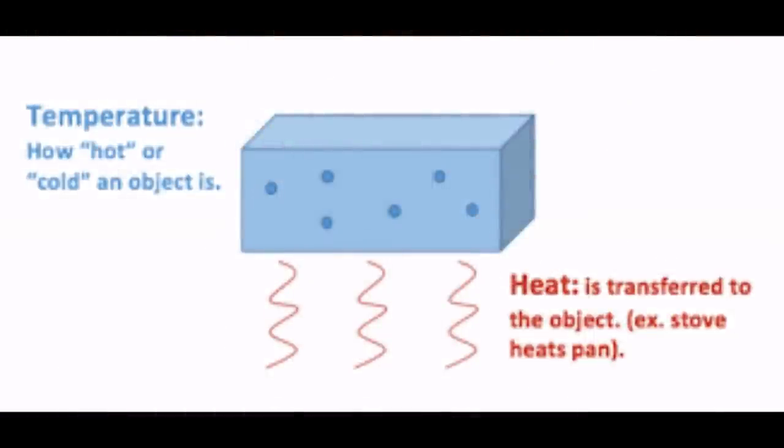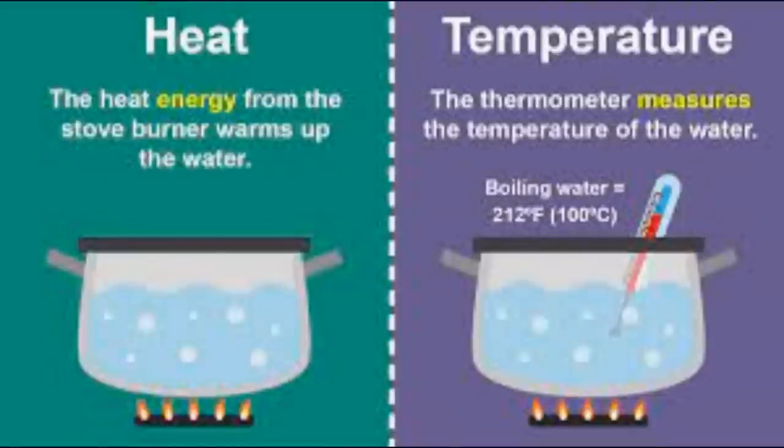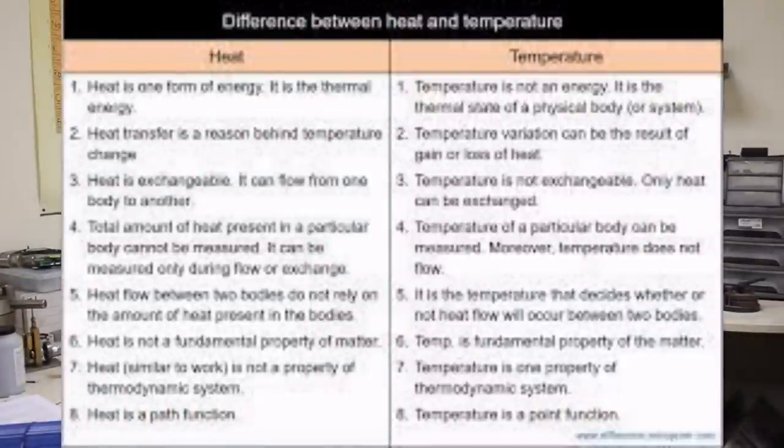Well, heat and temperature aren't the same thing. Heat is the amount of energy you're banging into something. Temperature is a measure of the amount of energy you've been able to keep in that thing. When we have something in the bare wind, like a light bulb hanging there and blowing around, it can't keep its heat in, so its temperature actually isn't very high. And that's great. If we surround that light bulb with a load of insulation, the temperature will go up. The temperature goes up because the heat can't go away, it's staying in one place.